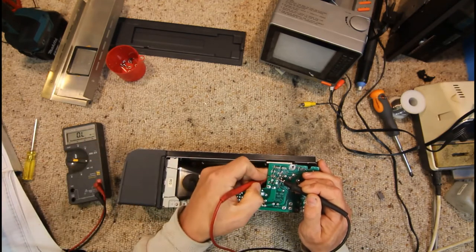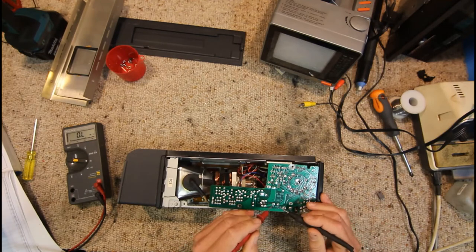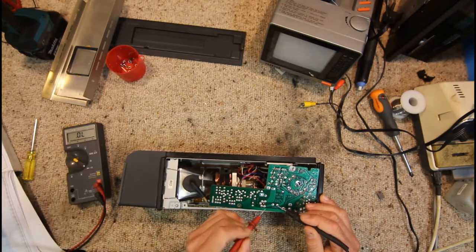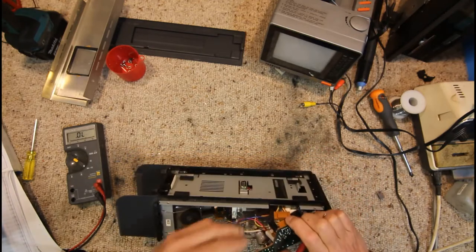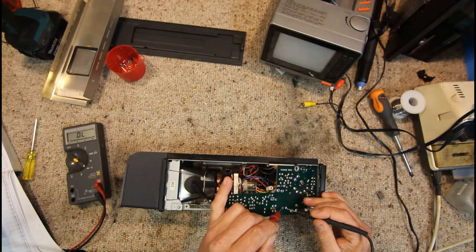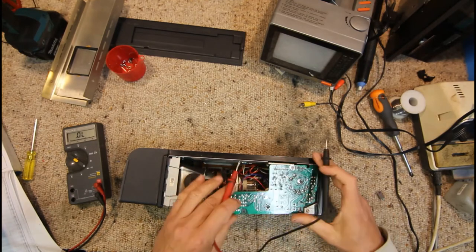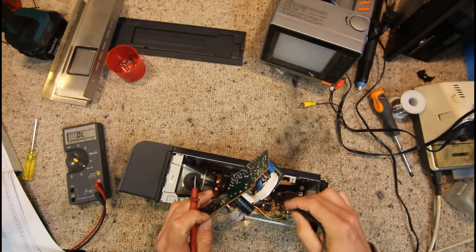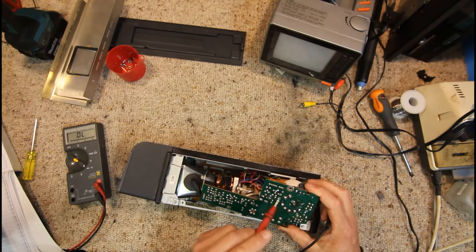There's quite a low resistance across our horizontal output — around 34 ohms. Disconnecting the yoke pin and going across the bipolar capacitor — the low resistance is gone, so there's no path to earth there. It's still on this horizontal output stage somewhere. There are often ancillary diodes that run other rails — maybe the picture tube heater — rectifying other pins off the line output to run other rails, but this is black and white so it won't have a lot of those.